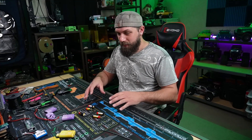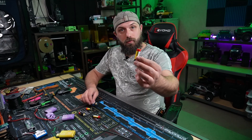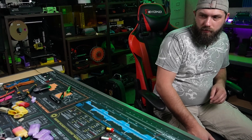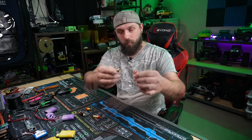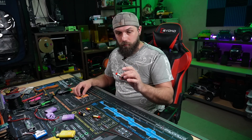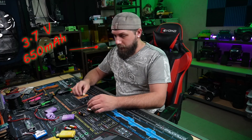With all my batteries extracted, I started looking through them. And like I said in the beginning of the video, it's better to have all matching vapes. In my case, I do have a difference between two of my batteries — I've got this short little one and then a little bit longer, less round one. These bigger ones are still 3.7 volt batteries, but I've only got two of them. These smaller ones I have four of, and they wound up being 3.7 volt and 650 milliamps. Four batteries is going to give me enough to build my 2S LiPo.